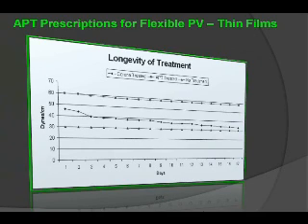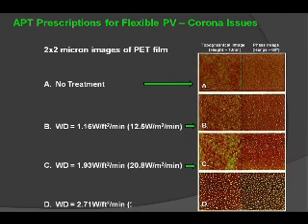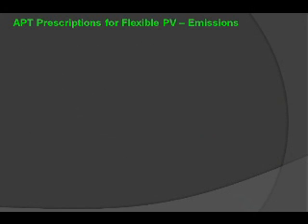Once treated, these materials have a very long life. As you can see by the top line, APT — or atmospheric plasma-treated surfaces — have a very low degradation rate. That is opposed to corona-treated or arc-based atmospheric ionizations of air, which are very reactive to the environment and will decline very quickly over time. There are also issues with air-based ionizations relative to different types of low molecular weight organics that can collect on the surface at certain rates or power levels.